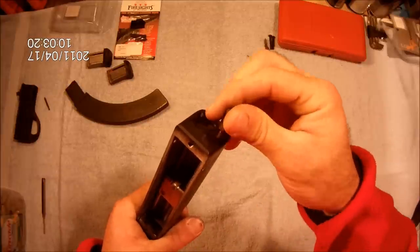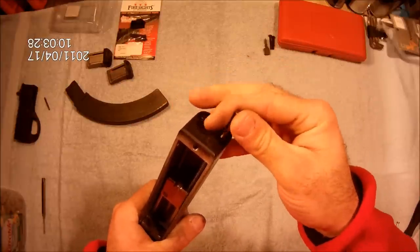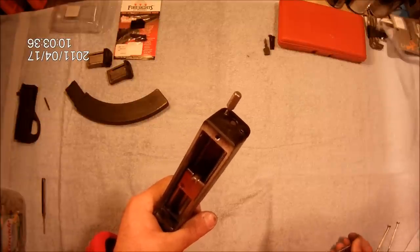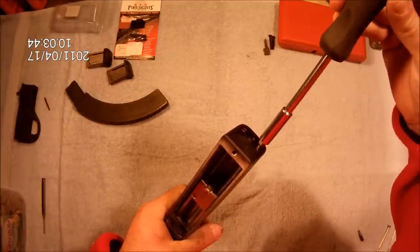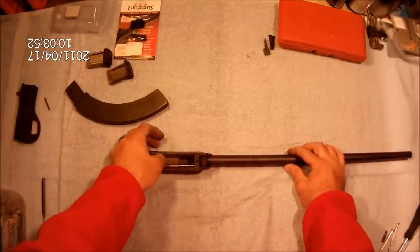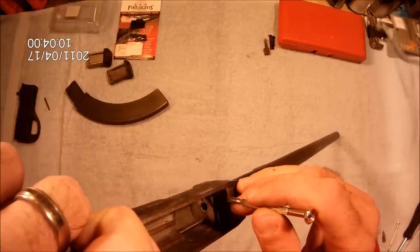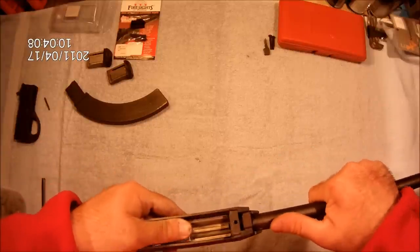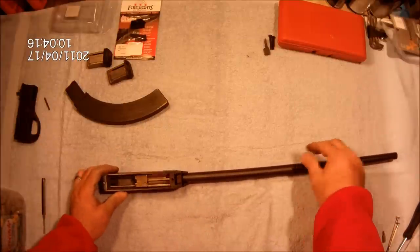Hold the receiver. They were only finger tight before, but I'm going to give them a tight finger tight — just nudge them a little bit with the screwdriver handle. I don't want them too tight and I don't want to strip them out because this is just an aluminum receiver. We'll make sure our bolt travels well — it seems to. Here's a view of the front end of the receiver where those two rods go in. Our bolt is making good contact with the breech face, nice and square. The recoil is good.